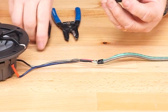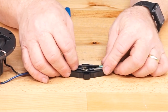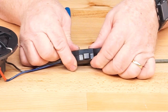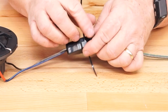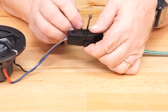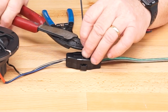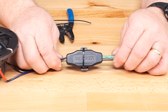Now it's just a matter of connecting the two gold-plated terminals together. Take the connection housing — if you notice the bottom has a little divider in it, place one of the connections on each side of that divider. Put the cap back in place making sure the cover seats tightly over the bottom fitting. Feed the wire tie through the slots, draw the wire tie tight, and cut the end of the wire tie off. You now have a safe connection for your marine speakers that will ensure the terminals do not touch each other and short out.